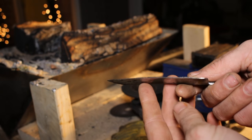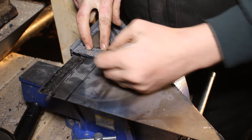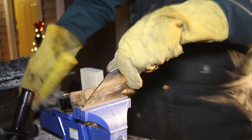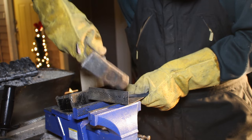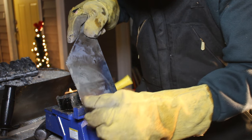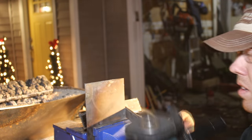Not too shabby — not the best thing you've ever seen but relatively straight and the shape I wanted. So then I took a piece of 16 gauge steel and cut out a rectangle that was twice the width of the handle with about a sixteenth to spare. I put one side of the handle in the vise and bent it over, then flipped it and used the vise to slowly pinch the handle shut so there's a nice little gap in there, then cut it free. That's how you bend the handle.